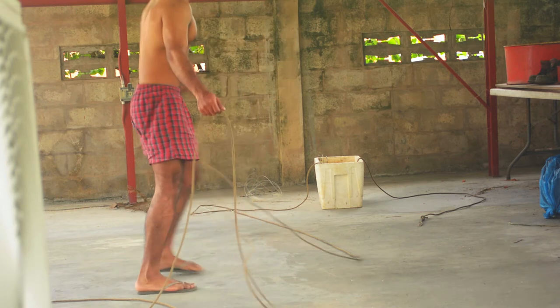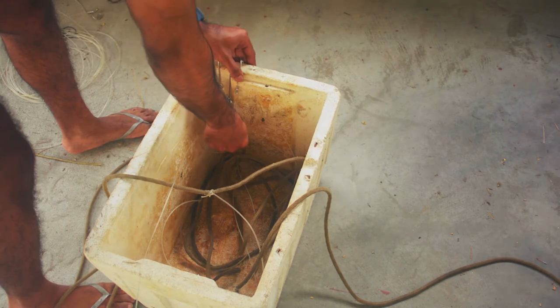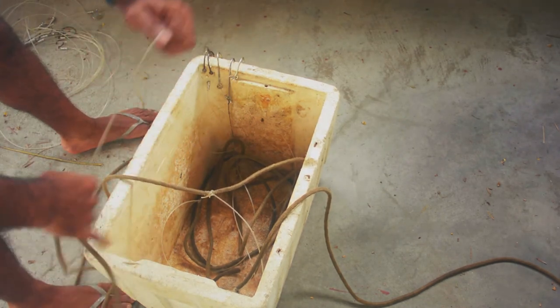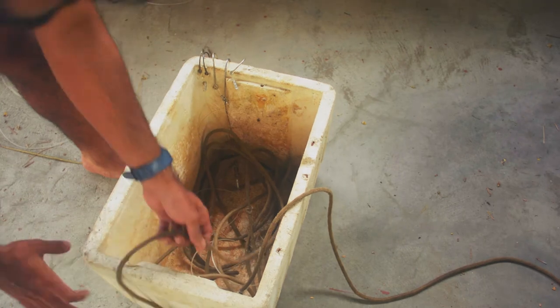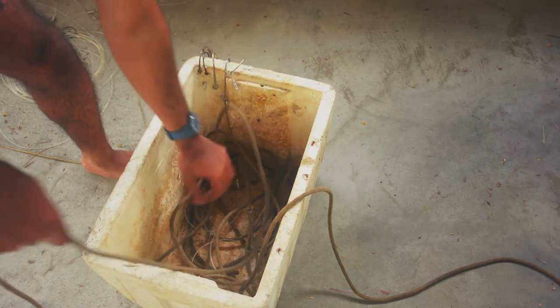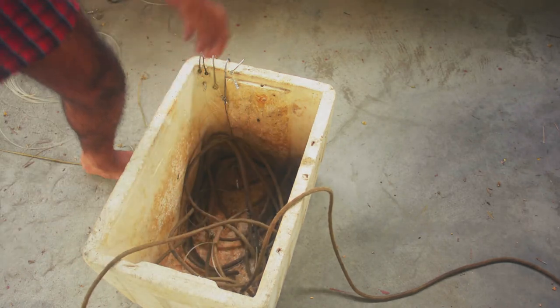We'll be using a polyester rope, and you'll want to be laying it out so you don't get any tangles and unwanted twists, because we will be laying out these hooks sequentially and setting them in order. Each hook is secured in place, the line is laid down, and then the rope coiled over it to hold everything down. Then you simply repeat the process until you have the desired amount of hooks.